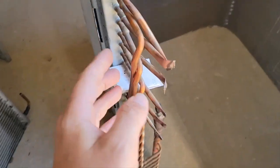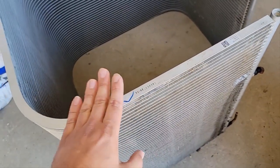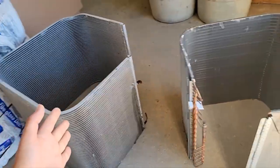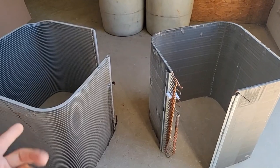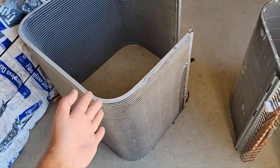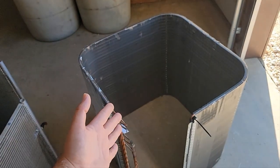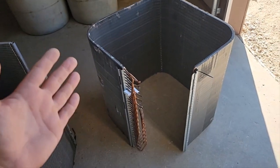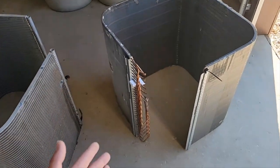This is a copper coil — can you tell that's copper? This is an aluminum coil and this is known as a micro channel coil. First I'm going to talk about maintaining or cleaning. The micro channel coil does not have to be cleaned with coil cleaner — you can just use water. The copper coil you usually clean with coil cleaner, and I'll show you what coil cleaner I use before we end today's video.